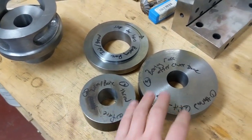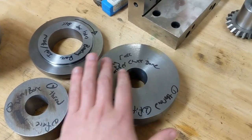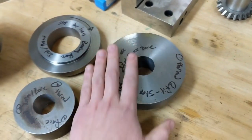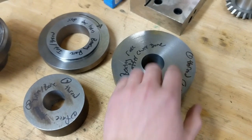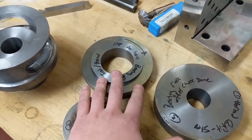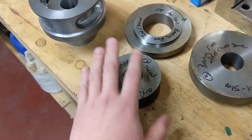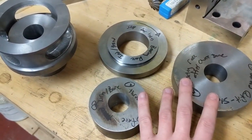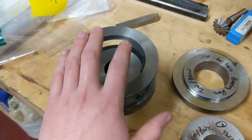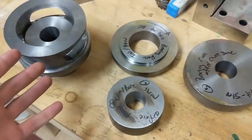Some of the steps are not all the same for each of the back plates. For this one - the lathe back plate - I have to bore and finish thread the inside, then mount it on the lathe and do the step that fits inside the chuck. Then I'll machine the step on the dividing head back plate, work on the locking ring, put everything on the mill on the rotary table to drill and tap mounting holes, then finish the interior of the back of the chuck to match the back plates.